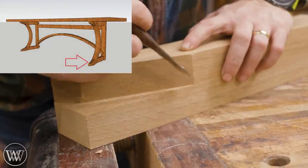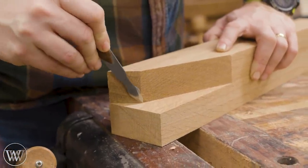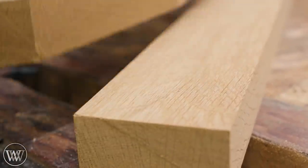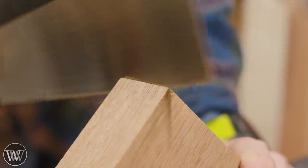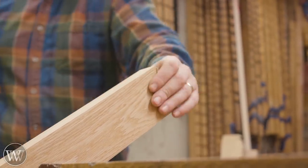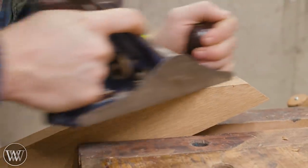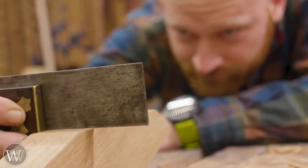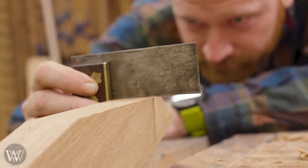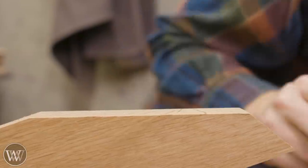So there are the six main pieces for the brace. The next thing we need to do is cut the angle on the foot. I used one of them, cut it with the measurements from the plans, and once I have that one where I want it, I can use it to trace all the others so that all the feet are exactly the same. The little bit on the toe — I find it easier to cut that first because we're going mostly cross-grain. I'm going to be using my carcass saw and it will cut across the grain very nicely. It is a daunting thing to stay close to the line on an angle, but if you take your time it goes pretty easily. And if you're off by a little bit, well, that's what they make planes for. For the larger cut I'll take it over and use the big handsaw — it makes quick work of it. Run it to the plane, just a few strokes to get rid of the saw marks, then check it for square. I need one more pass right down by the toe, then check it again — nice and square all to the sides and ready to go.